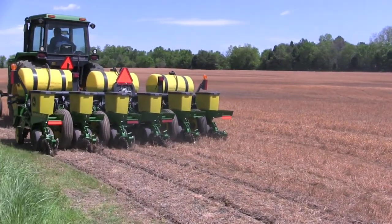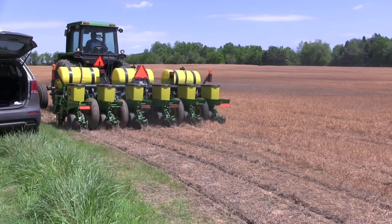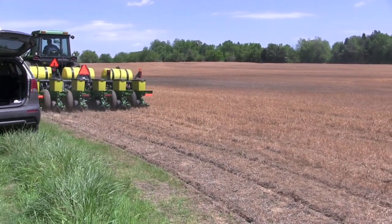The first way we figured it out was when we put the light bar in our sprayer — we noticed an initial chemical savings mostly because we figured out how many acres we had to spray, bought the chemicals, and then when we got done we had more left over than we thought we would. We noticed a certain percent savings from that. The light bar guidance is the easiest thing to get into, and the price of light bars has really come down. You can get a good quality light bar for about the same money as a foam marker.